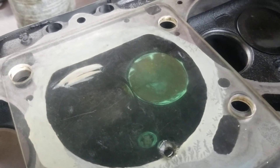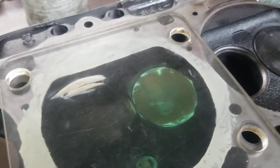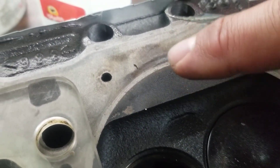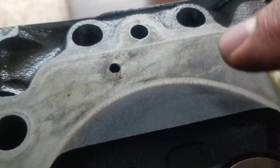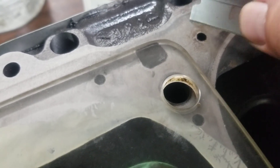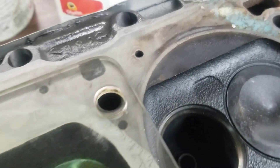What's occurring here is the compression is leaking by the head gasket, and you can see it with this indication where it's coming through the head gasket — this black carbon — and it's pronounced here. This head was just surfaced 300 miles ago or less, and you've got blackening all in here, which is carbon coming through. That's because the surface is like a file — it's as coarse as a file. And that's not good for a head gasket by any means.